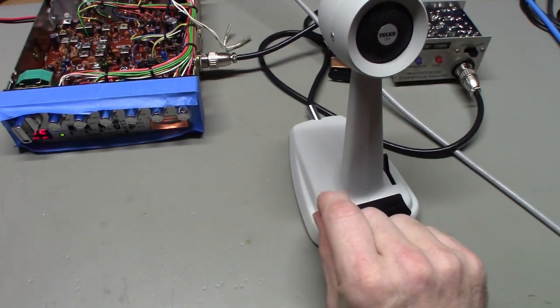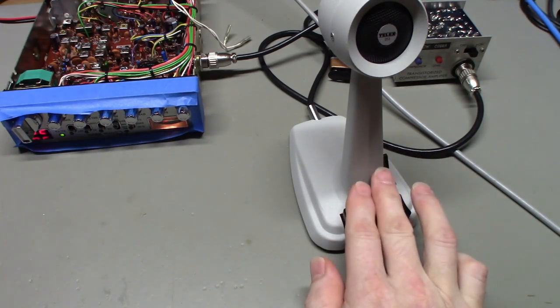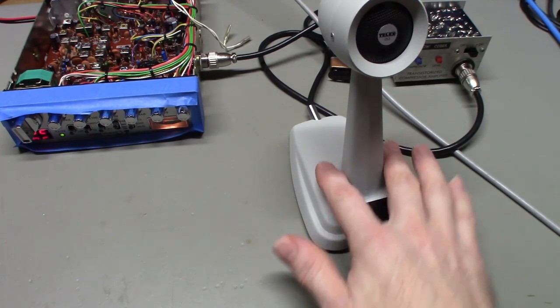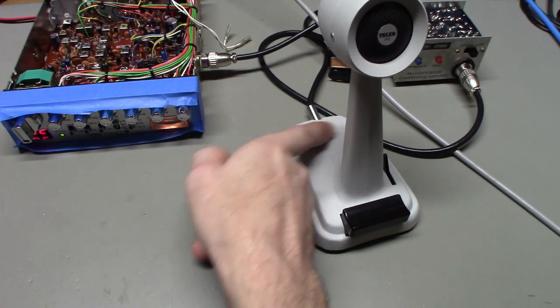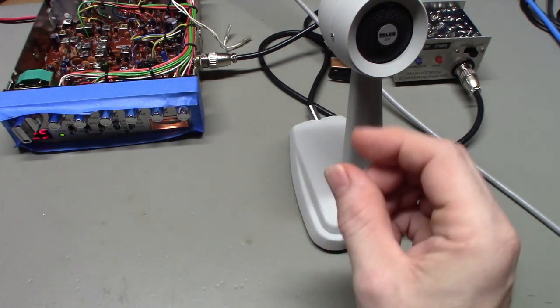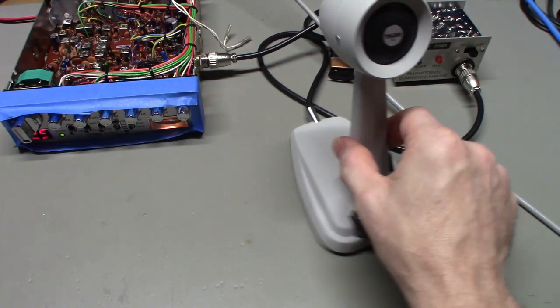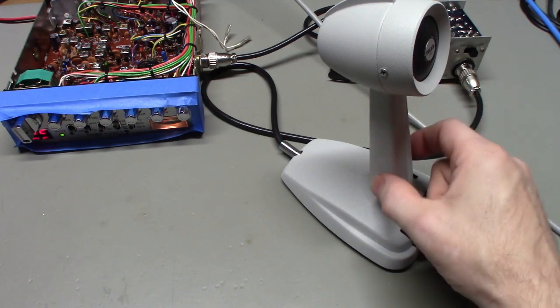I don't have the depth, really. I can't really stick anything up here because the switch contacts are here. The push to talk button switch has two arms that come, with the pivot points here. There's nowhere to stick a battery up here. The only place would be back here, and you're left with that much room. It's just no room. So that's what I used in here, a BR 2/3 C battery, lithium cell.